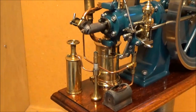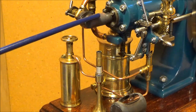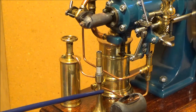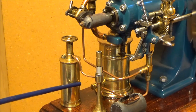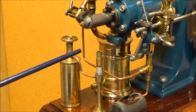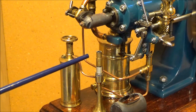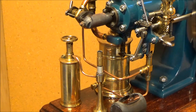The hot bulb — this one — is heated by means of a blow lamp. This is the gas bottle for the blow lamp, and the flame must be burning all the time the engine is running. The flame must be adjusted properly: too much heat and the engine will pre-ignite, and too little and the fuel will not be vaporized properly and the engine will stop.